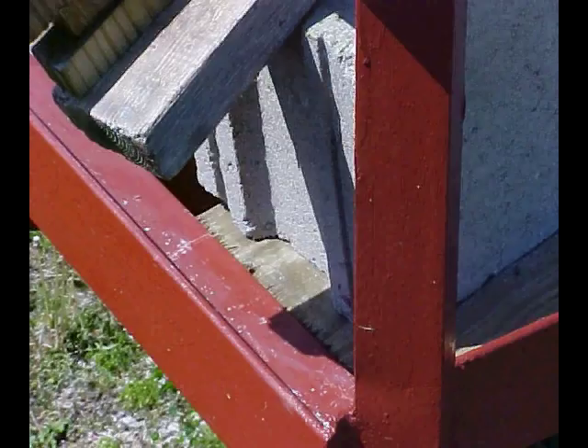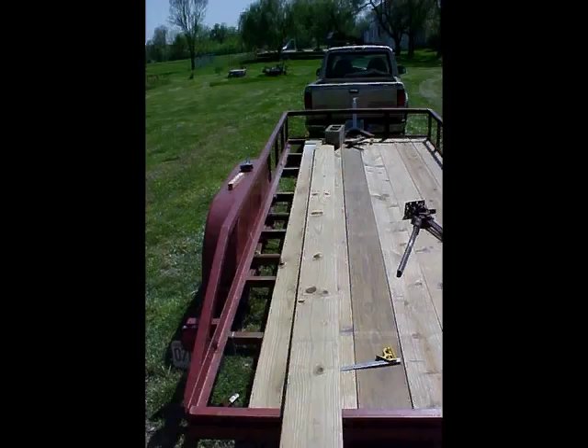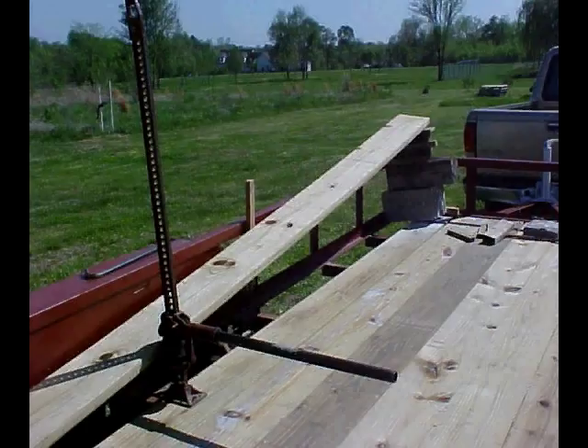Now use your pry bar and hammer to move the boards into place. Now for that eighth and last board, you need to place your jack on the trailer deck. Again place it about one-third up from the fitted end. Make sure your jack rests on a frame member of the trailer to allow for good support. You can see in the photo I made a mark where to set my jack. I need to raise the weighted end of the board in order to get my jack under it, but once that's done I proceed to bend the board just like the last two.